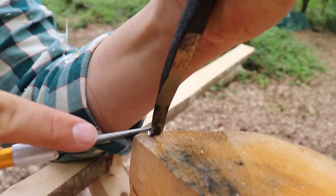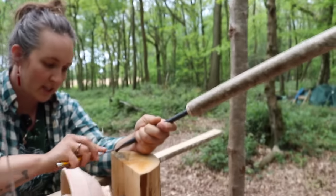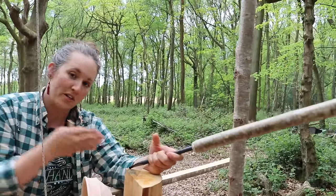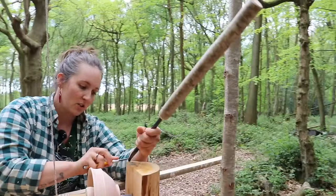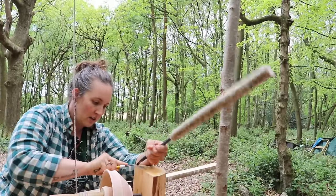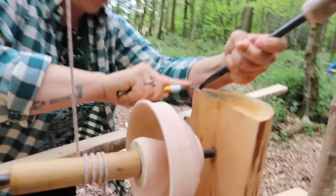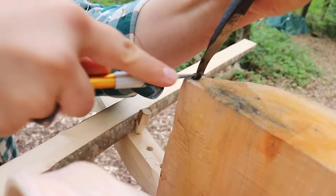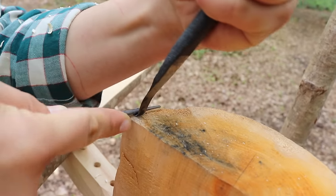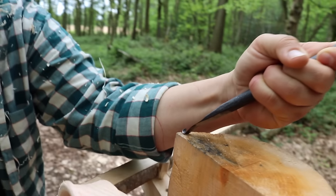And the key really is that as you're moving, so I'm kind of rolling and pressing down, I don't want to go in one spot, because then I'm going to make a divot in the cutting edge. So I'm just consistently moving the sharpening tool and the hook, kind of rocking it back and forth. If you're new to sharpening, it's really helpful to put a bit of Sharpie in there, and then you can see that you're actually grinding the parts that you want.